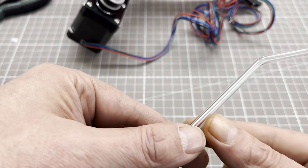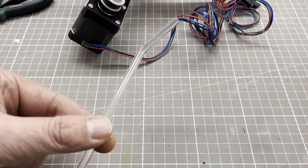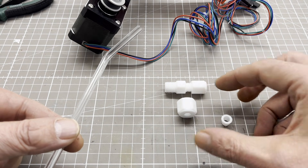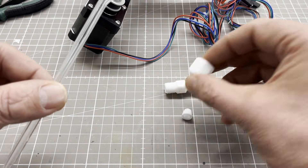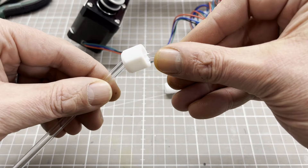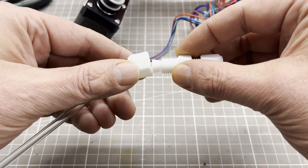The probe that pumps liquid out of or into the sample bottle should be as inert as possible. I therefore made it from 6 mm borosilicate tubing. To connect the PTFE hose, I use a compression fitting, which is also made of PTFE. It accepts the standard 4 mm PTFE hose. These PTFE compression fittings are available at low prices in all kinds of designs on AliExpress as well.